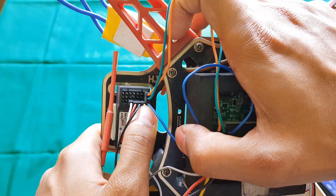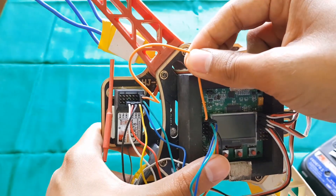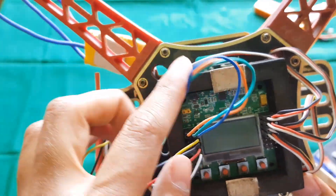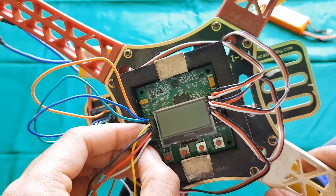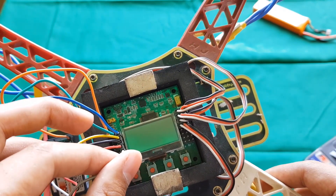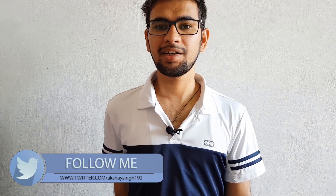The green wire is positive and connects at the middle pin. The outer wire is negative and connects on the outside. For the remaining connections, you will notice there are no positive or negative wires — only the signal pin is connected. This is because you only need to power the receiver once; you do not need to power it again through the flight controller. Channel 2, 3, 4, and the auxiliary channel 5 each get only a signal wire connection, completing the interfacing. At this point you have completed around 80% of your work.